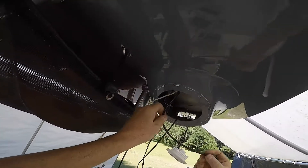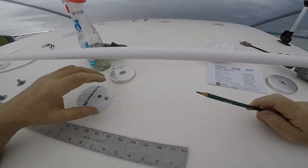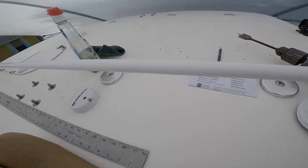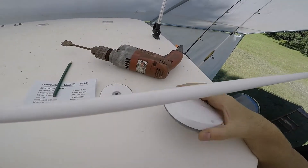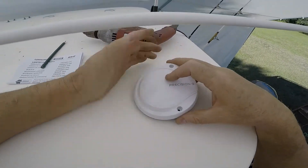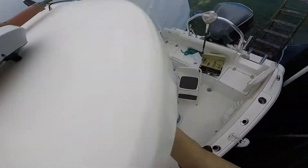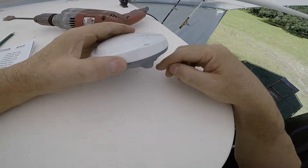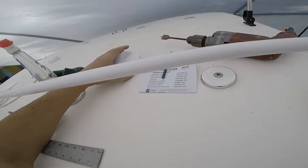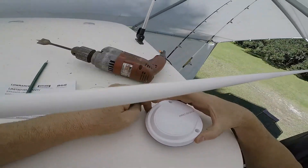I came off of this GPS device and drew a center line off of that — the compass will be faced in this forward direction. This is the fitting that attaches underneath, and you've got to make sure there's nothing under that location. I have a light here that I'm going to clear for. I'm going to drill a small hole first to see where it comes out, and if it looks good I'll go through with the bigger hole. This is going to be the approximate location.